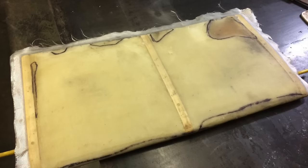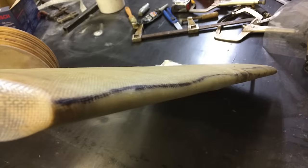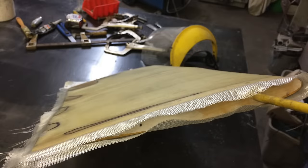I started work on the rudders. They were made with three wood airfoil shapes, then covered with clear plastic. I poured expandable foam, then sanded it to shape, and fiberglassed them. The rod supporting them is from a fiberglass roadway marker, so it will not corrode or swell with humidity.